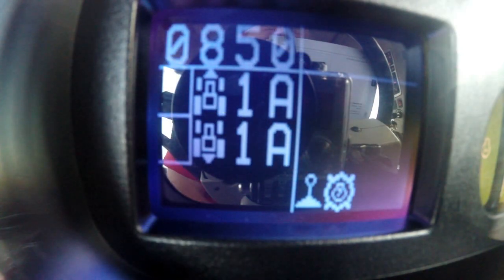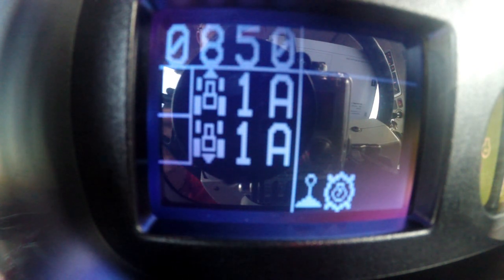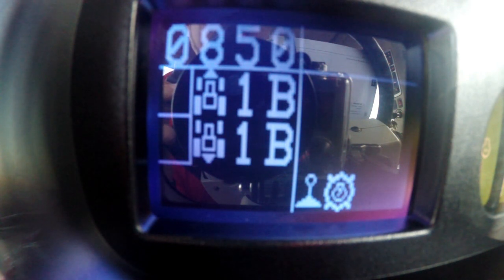The first screen is going to show in our upper left-hand corner where we can set our engine RPMs. We also have displayed our takeoff speed for the forward direction and our preset takeoff speed for the reverse direction. If you want to change your takeoff, you're going to push the clutch pedal in, move the T-handle lever into the forward position, and push both the T-handle on the right and the forward lever forward. You'll see it changes to 1B, 1C, 1D.